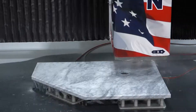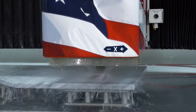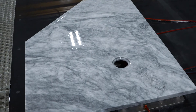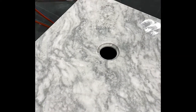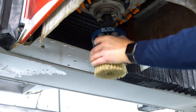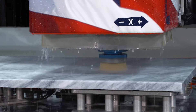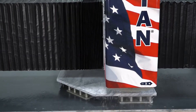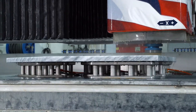As soon as we're done with this milling wheel we'll take a look at the piece to see where we're at in the process, then next we're going to switch to the first brush. So now, if we weren't going to leather the piece any further, this would be our finished product. You can see in the reflection of the light the tooling pattern from the Titan. We're going to take it one step further and run leather brushing across this — the finished product once you leather it is just beautiful, it's phenomenal. We'll transfer to our Blick brushes — a real simple process — and we're off and brushing. Here you can see the first brush going around, basically the same program we ran with our milling wheel, just repeating it again with the brush. You can actually see that Z-axis going up and down, the brush following the contour of that pan, creating that contour brushed finish.